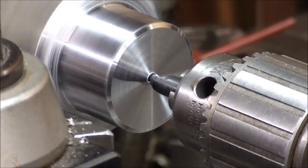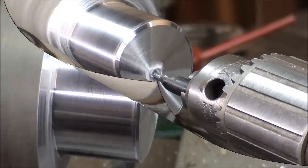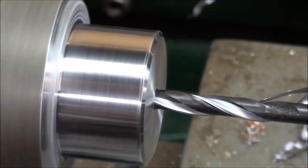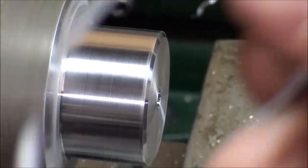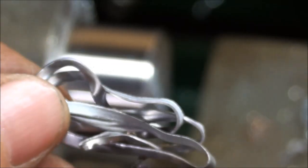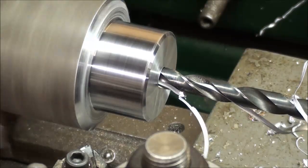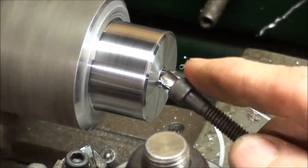Lead is self-lubricating. Now for the quarter inch bit — I'm going in 1 inch. Nice soft chips. And this is the 3/8ths for the counterbore. The depth equals the length of the head on the cap screw.